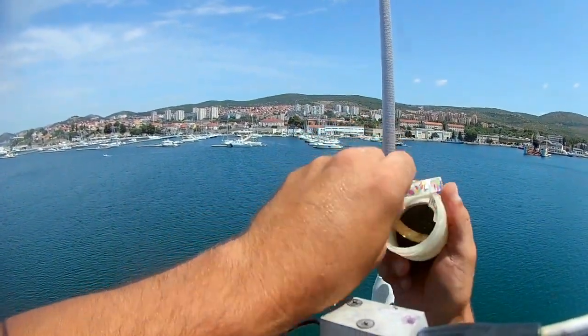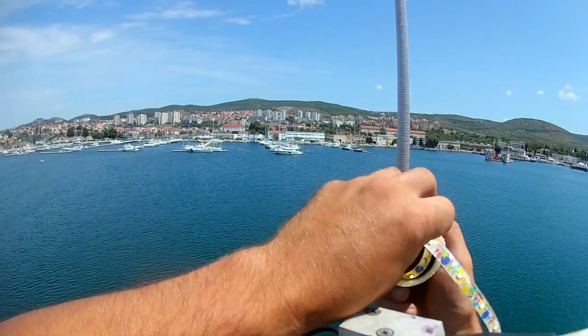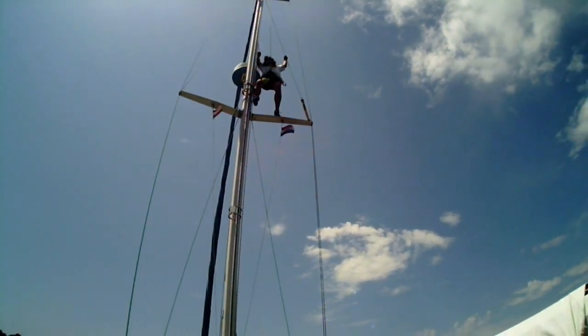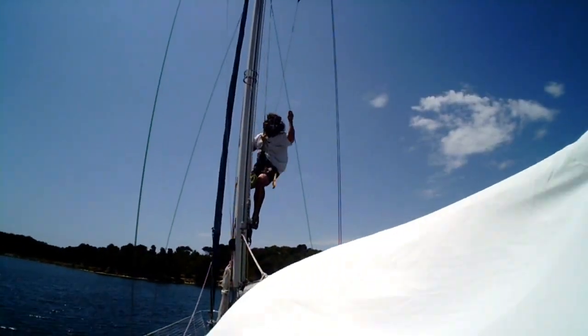Trying to get the LED strip into the anchor light cover was a little bit more tricky, but I'm pretty good at using my hands. I fidgeted it around a little bit, got it in there, and then of course the video ended, so we don't really have a picture of the anchor light sitting back where it's supposed to be. Coming back down, we can see the light is working. I called my friend in the marina and he said yeah, we can see your light. And it's drawing about 0.3 amps, compared to 1 amp of the original old anchor light — we did a pretty good job.